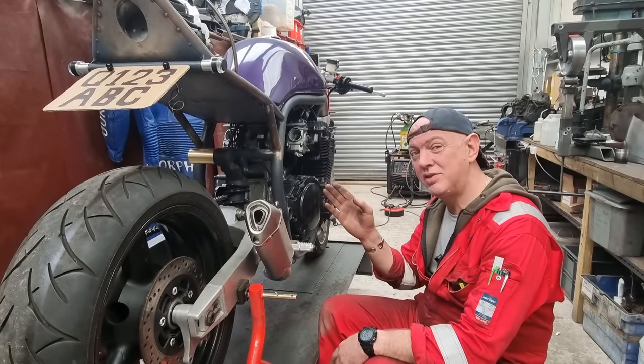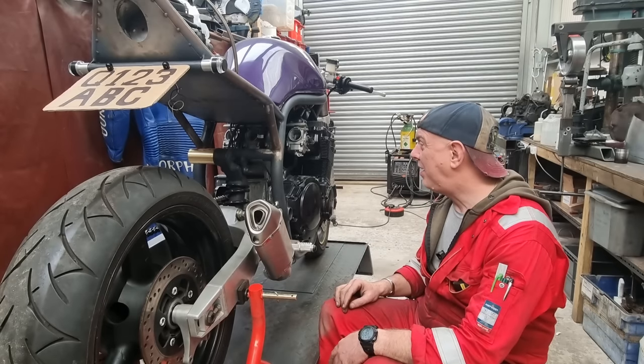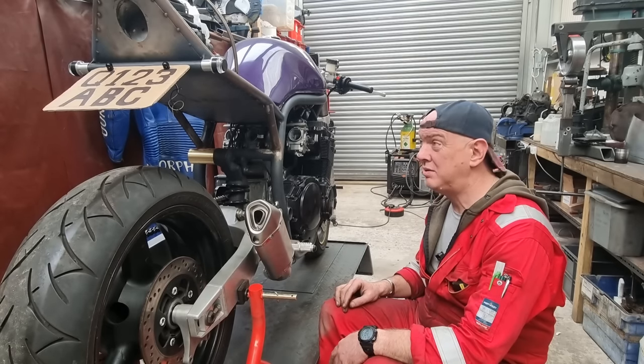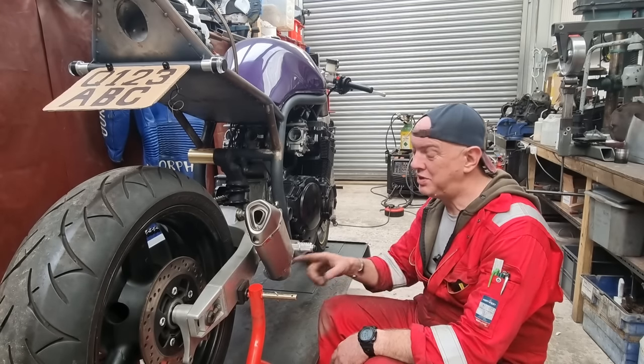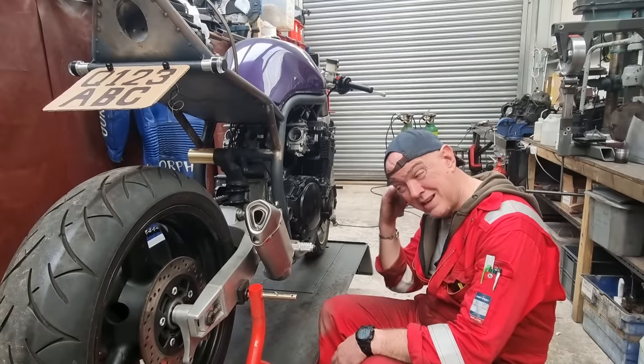I want to check all of them, but the most important thing is that the fueling is right between 3.5 to 7, because it's lean at the minute. Whatever power it makes, as long as it's usable power and the curves are all nice, I'm happy. And then we'll see what Mr. MSVA says about getting close to 99.